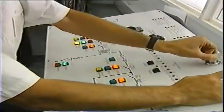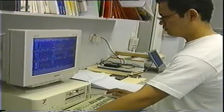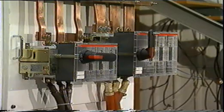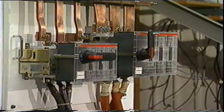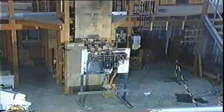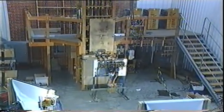In the comparative tests seen in this video, the MCCBs and fuses used were subjected to exactly the same fault interruption demands under exactly the same conditions. With their demonstrated ability to interrupt very high currents while fully protecting downstream equipment, and most importantly, ensuring complete operator safety, HRC fuses clearly and substantially outperformed moulded case circuit breakers.